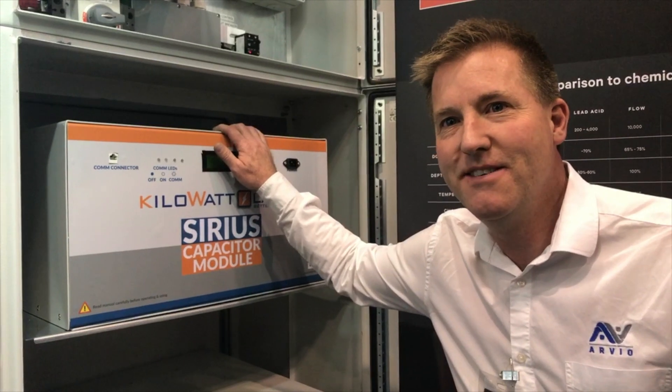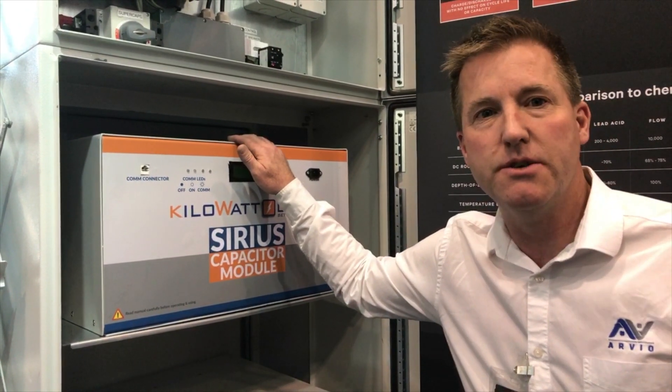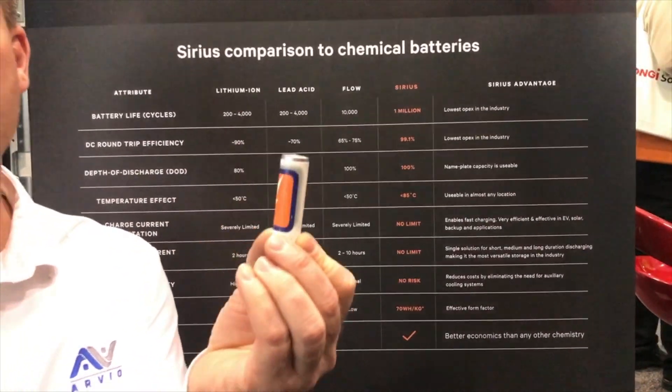3 cents per kilowatt hour life to store energy over 40 years is extraordinary. There's no loss of power over time — one million cycles. The trade price is about a dollar per watt hour, similar to LG Chem and Tesla Powerwall, but when you compare it on a million-cycle basis and real cost per kilowatt hour life, you can't consider those anymore. This is the first version — the next release will be twice as dense at 14 kilowatt hours in the same physical size, and after that three times as dense. The future is supercapacitor storage: not dangerous, not flammable, not toxic, recyclable, environmentally friendly, and affordable.